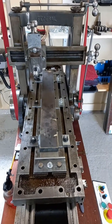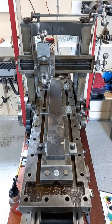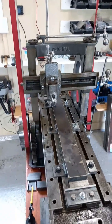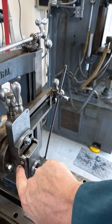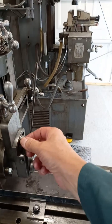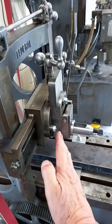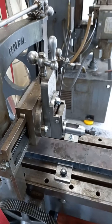Hello and welcome back to the shop. I've been doing a bit of work on the planer again. I've been working on the tool head — you might be able to see some scraping marks on the front face of the tool slide. What I had to do is scrape that face and the back face of the actual tool holder, the clapper itself. What I found was that when I tightened the original bolt up here — which was a cap screw, which is not very good — when I tightened that up, this sort of kicked out at the bottom, and when I checked the face on this it was three thousandths out.